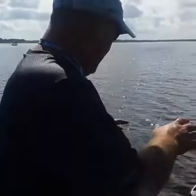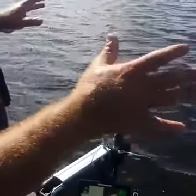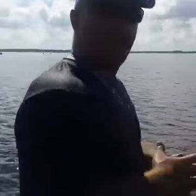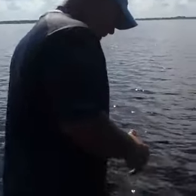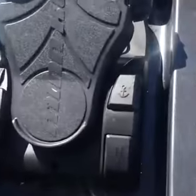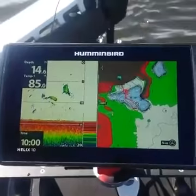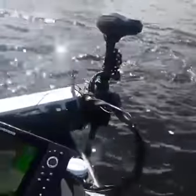So this piece of equipment right here is going to change bass fishing, because a lot of walleye guys and offshore guys have been used to the Ipilot system. Well, we didn't have the spot lock when we're fishing out deep. Well, now we do, because all I've got to do is hit the anchor button on the foot pedal, and now I'm spot locking. I'm going to save this spot. I'm going to be able to fish on this spot for however long I want. The trolling motor is going to adjust. It's going to probably keep me in a 3-foot circle at the bow.